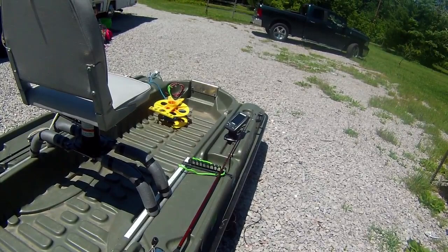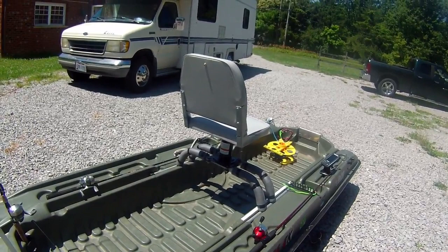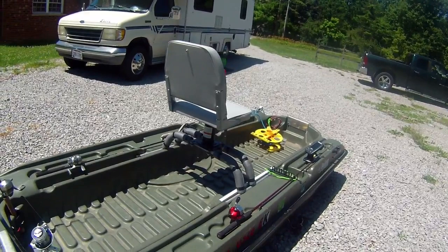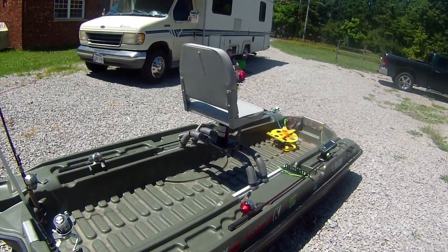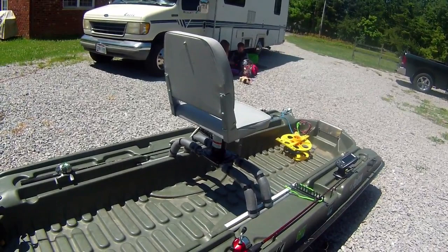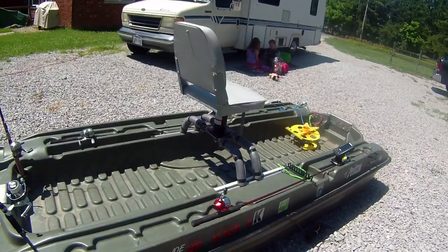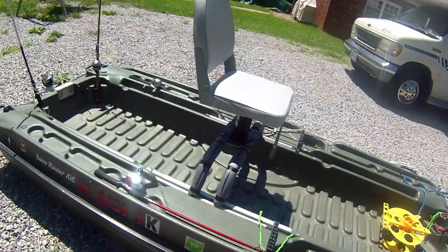I can hold up to two rods on each side comfortably. I also added a seven-inch pedestal to my seat since I am six foot six, which gets me up higher so I can cast a lot easier. Being up higher above the water is a big improvement. I wrapped the bottom supports with pipe insulation, which does wonders — on a hot day you don't burn your legs when turning in your seat, and you don't bruise yourself by hitting the seat. I found that tip on YouTube from someone with a similar boat.